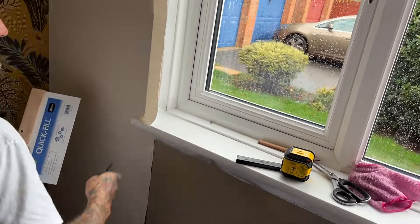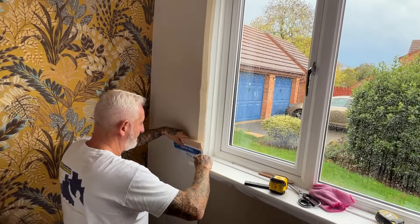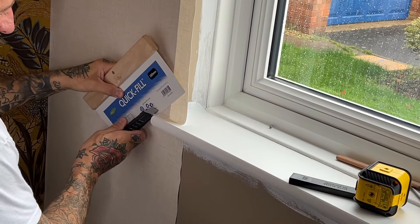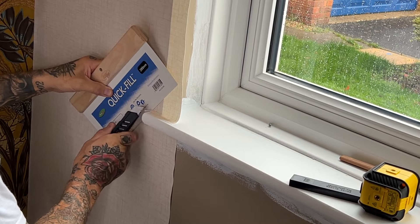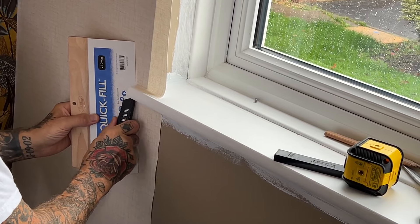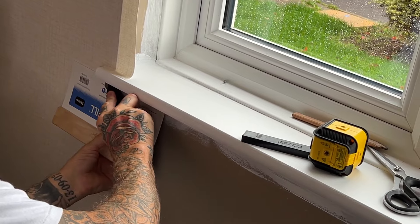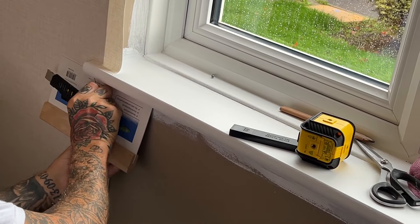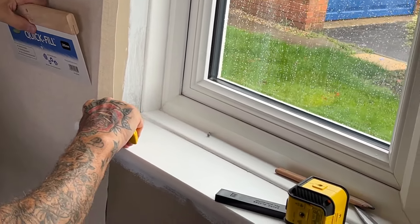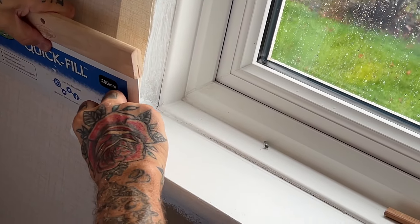Next, with our corker and blade, we make our cuts. Just carefully and gently cut along the top of the sill, cut around the curve — take your time with a very sharp blade. Cut underneath, and this cut here just goes up to slightly past where our window reveal is, so that will just release the paper.